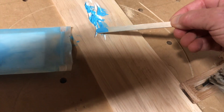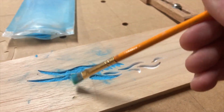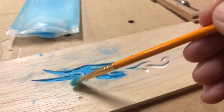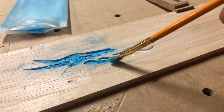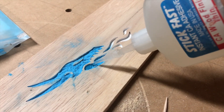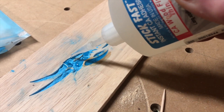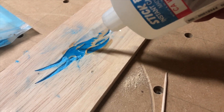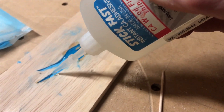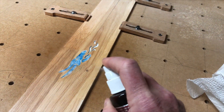After the paint had dried, I filled the routing with some aqua glow-in-the-dark strontium aluminate powder. Then I used a brush to clean up all the excess glow-in-the-dark powder and to make sure that all the gaps were filled in the inlay. Next, I flooded each of the cavities with water-thin CA glue, which will saturate that glow-in-the-dark powder and make sure it adheres firmly to the inside of the inlaid cavity. I let it sit for about 10 minutes, then hit it with some accelerator, and that gives it this unique crystal-like look.